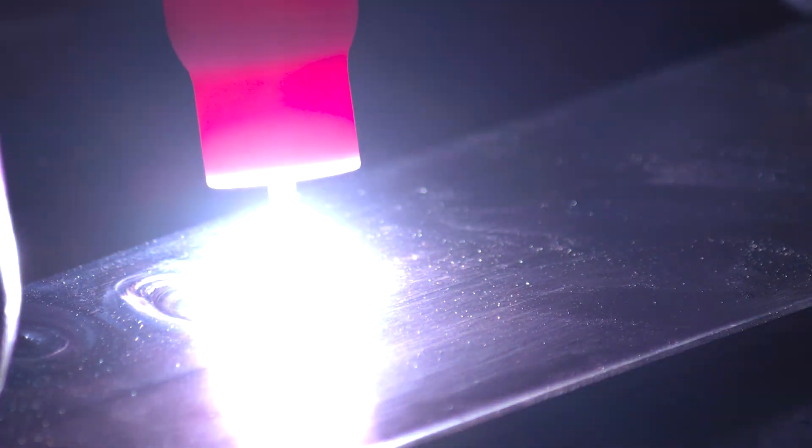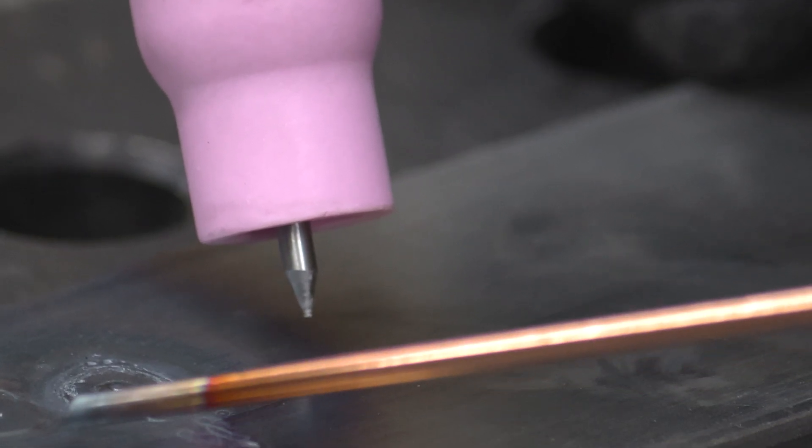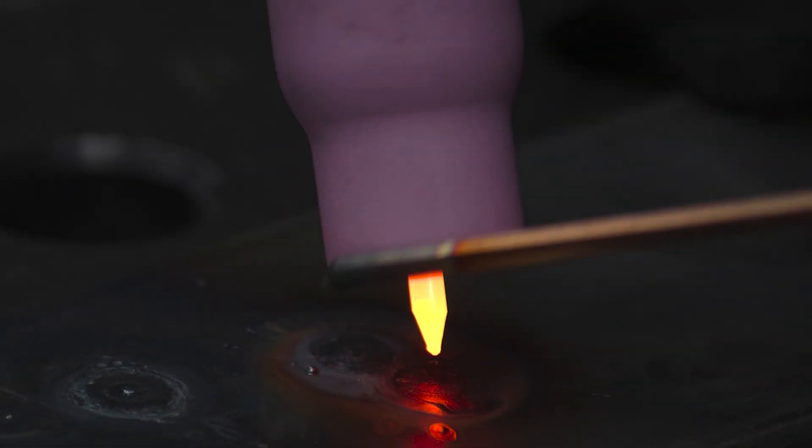One thing you'll notice is the tungsten wants to stick to the material when you do that — you want to be quick and methodical. Live lift mode is more for situations where you don't have the finger switch, like if you put an aftermarket torch on without a thumb switch option, or if the thumb switch is uncomfortable. My personal favorite technique with live lift is to flick the filler metal right between the tungsten and the base metal — that causes the arc to initiate. There's less surface area interacting, so it's a quicker flick with a lot less chance of sticking or snapping the end of the tungsten off. In my opinion it's a smoother, cleaner arc initiation for lift arc.